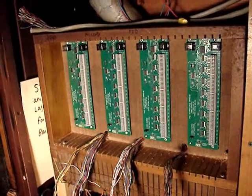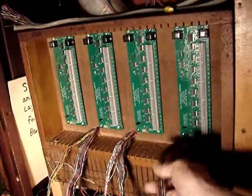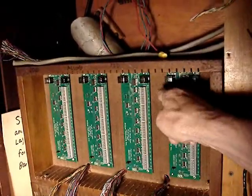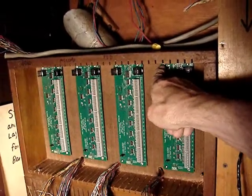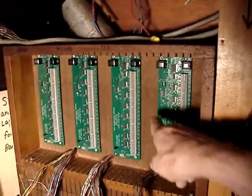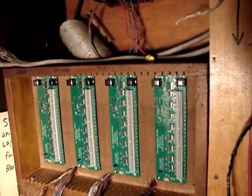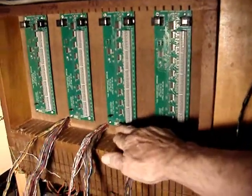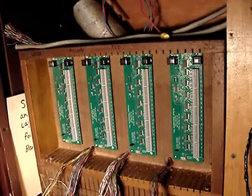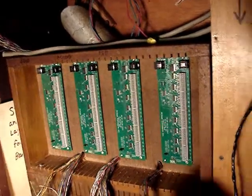Well, one thing I could do is I could turn the boards around. The problem is that puts this on the opposite end of where I ran the bundles through. I could drill holes up here and run the bundles up from there, but that gets it kind of close to here, and I don't like that. I could bring the boards down lower and then drill a hole up around here, and still that brings me close to where the data ribbon cables connect together. And of course, if I go too low, I got to remember I have to attach ground wires to these lugs here. So my only option is to actually wire it the way I've got it in.